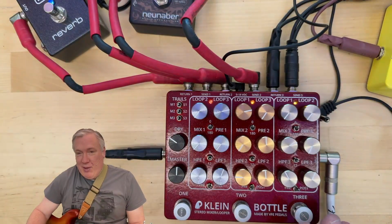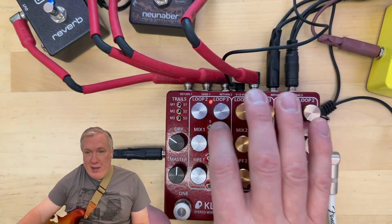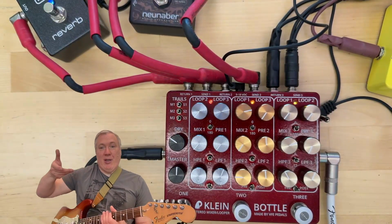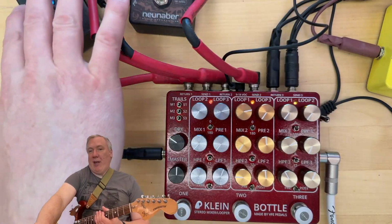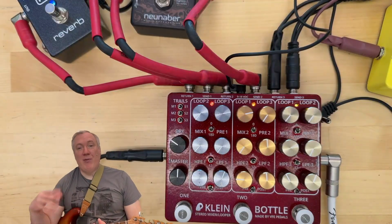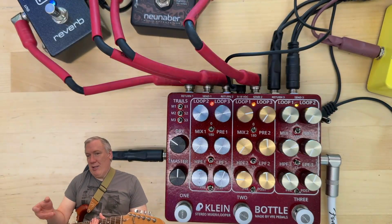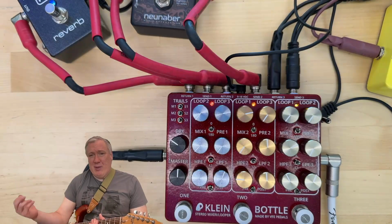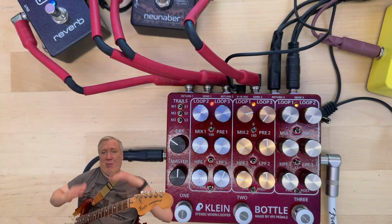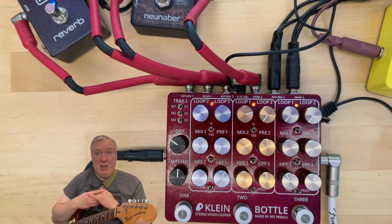So the last few things that I haven't mentioned yet is that there are phase inversion switches, which will flip the signal over, because some effects, and you often don't know, it's not part of the specs, will invert the signal, potentially causing phasing issues. And in some cases, it's just fun to switch it to hear how they sound, because unless the two signals are perfect and then you flip one over, that's an obvious phasing issue that you will definitely hear.